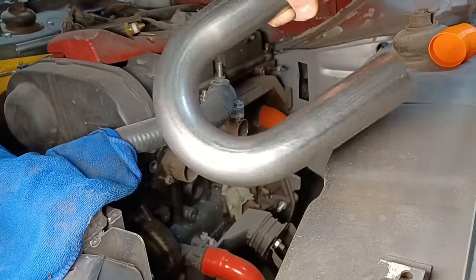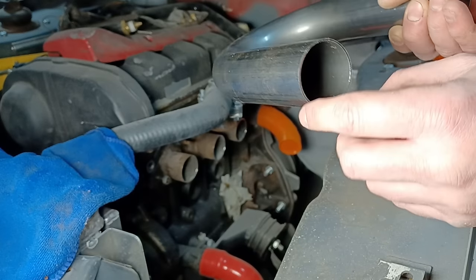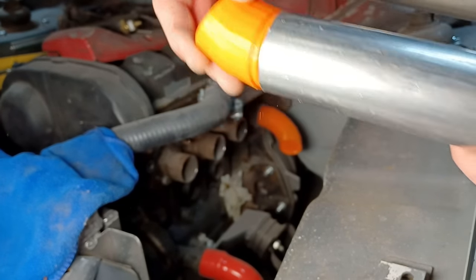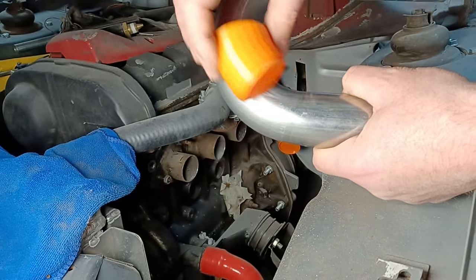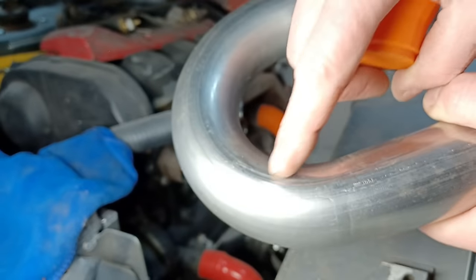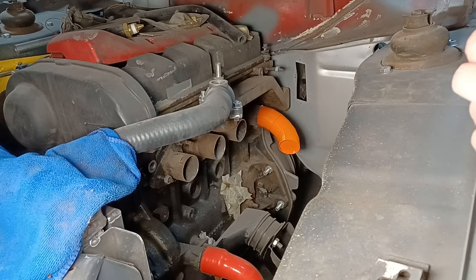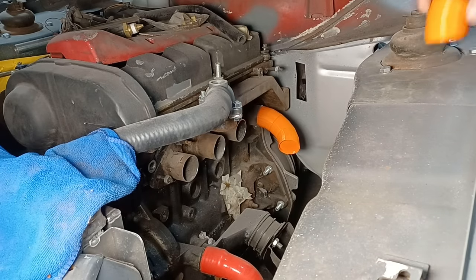The bends are inch and three quarter — about 44mm — and the little pieces clip in so I can work with them. These are 30 degrees each, so three make a 90 and six make a full 180, meaning I can shape up whatever manifold I want and use that as a pattern for making the steel bits. I've got six of these and a few metres of straight pipe, costing about £110 for the steel. The printer filament is basically peanuts — they're printing as I speak.